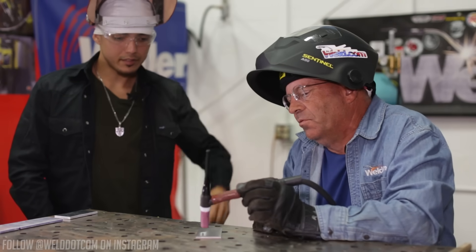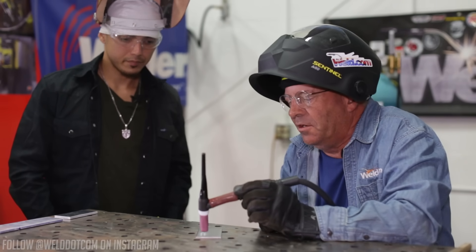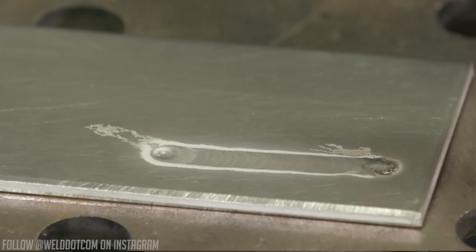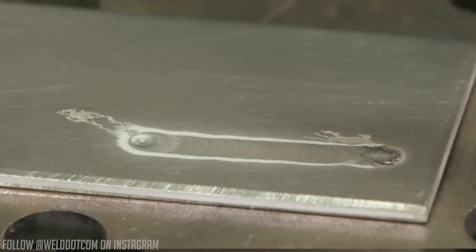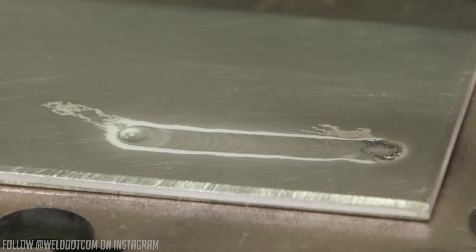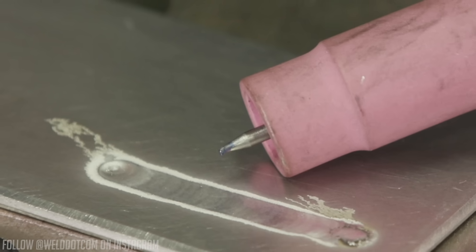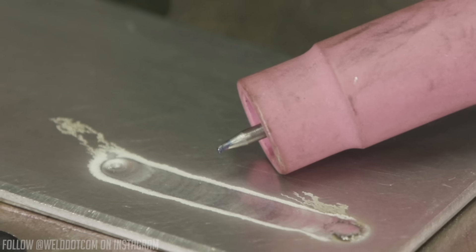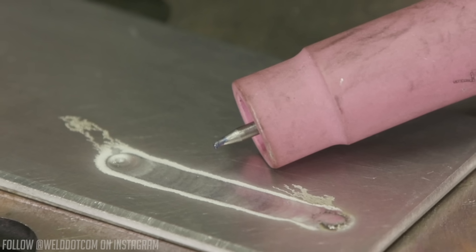Okay, you hear that tone? It took a second to break through that oxide layer - you can see there's a little black veil around it and then it cleaned up. You can see the haze on either side of the bead. But look at my tungsten - it didn't really do anything to the point. That's a pretty generous point and it just barely deteriorated.